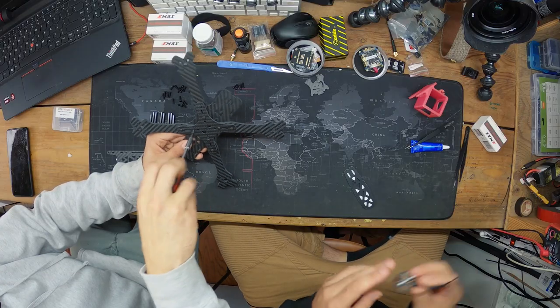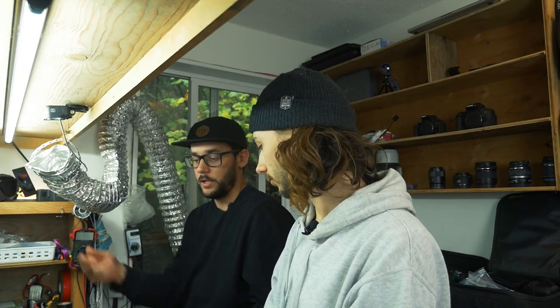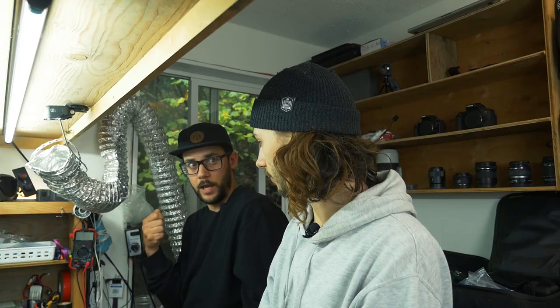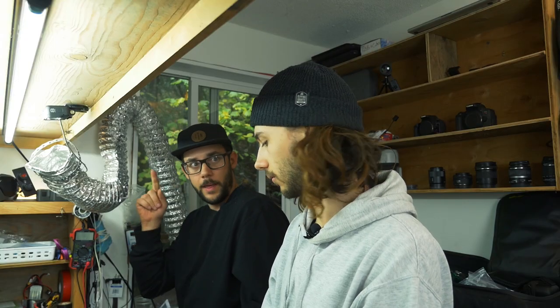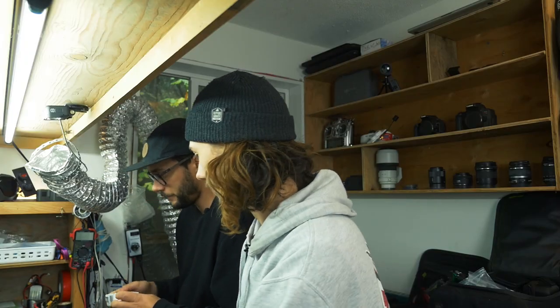While Akayla gets the final frame screws in, we'll move on to motors. My build order for a brand new quad is: frame first, then motors, then ESC, then solder the motor wires to the ESC, solder your XT60 or power connection, then check for any shorts with a multimeter before attaching anything else.